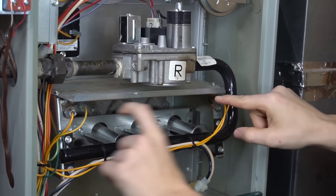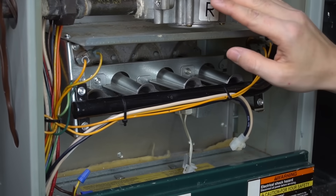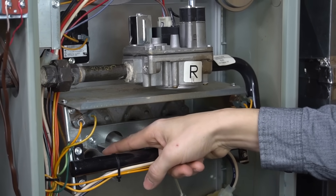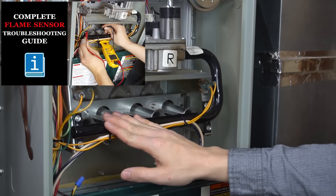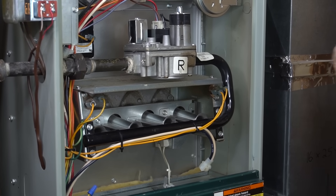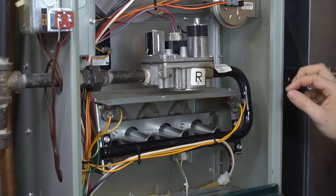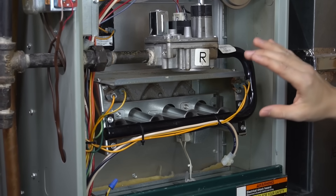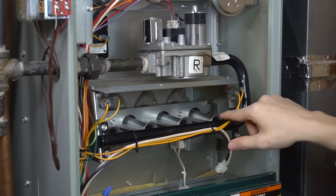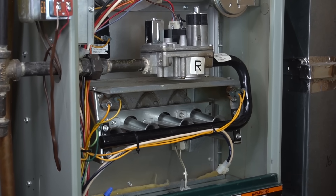The igniter is on this side — on your furnace it might be on either side, but usually it's on the right side. The flame sensor's on the last burner. The purpose of the flame sensor is to turn off the gas valve if it does not sense that there's a flame. I have another video that talks in detail about the function of the flame sensor and how to troubleshoot it. And just to note, if you don't hear your gas valve click and open with gas hissing out of the orifices for about four seconds, most likely your problem is not the igniter.